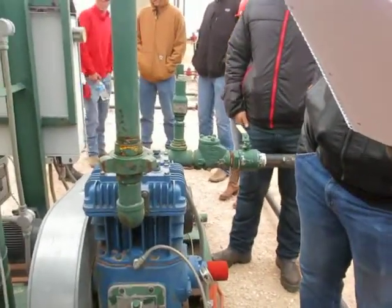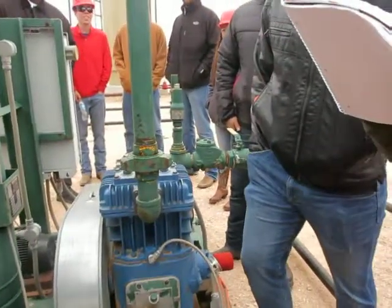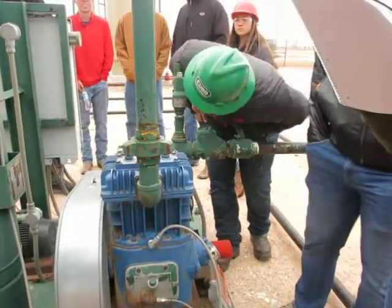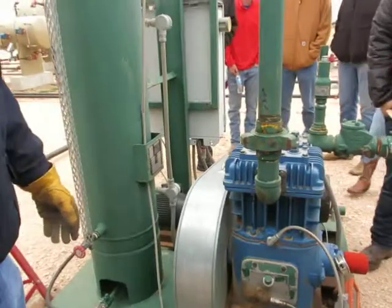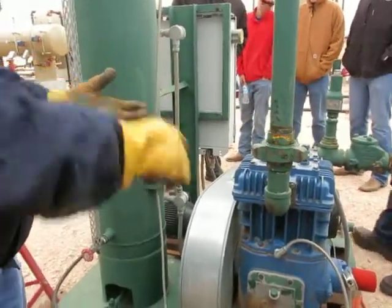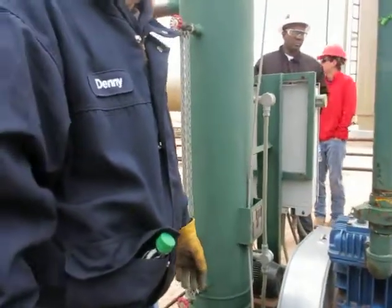So what about the maximum for sales line pressure? That's set by your sales contract. It's generally going to be in the range of 50 PSI or something. The contract may say 100. You'll probably run 50, and the day they jack it up to 75, you'll go say, "Dave, you raised my line pressure." And he says, "It's in the contract, I can do that." And that happens when there gets to be too much gas.